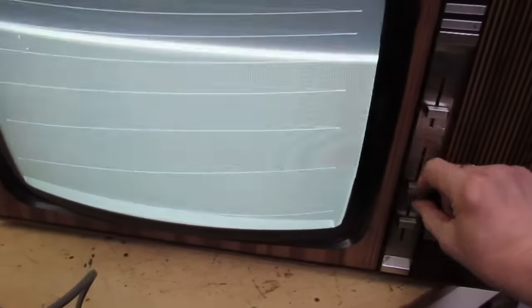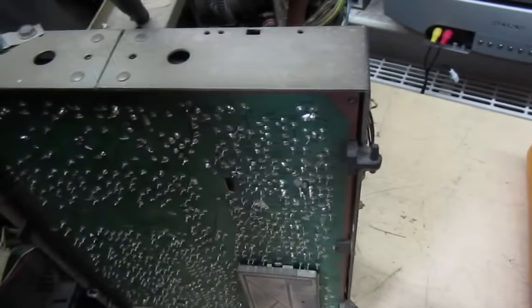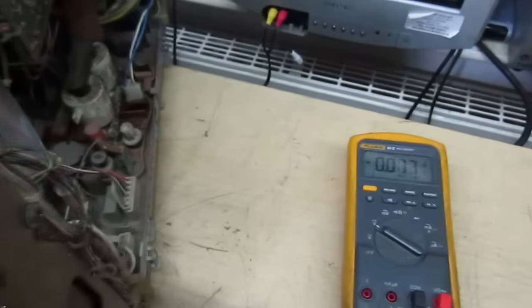I've managed to tune the sound in. But the brightness control has no effect, so we've got a fault in the video output stage. The prime suspect would be the video output decoupling capacitor. Checking the collector voltage of the video output transistor on the decoder panel - it should be about 180 volts, but we've only got 20 volts. So it looks like we've lost the supply for the video output stage as well.